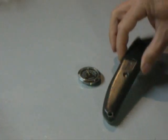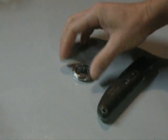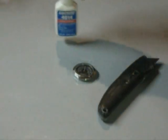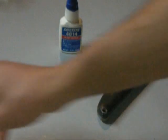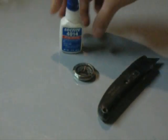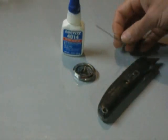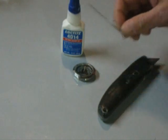Hi, this is Mike from StemCaptain, and I'm going to show you how to recalibrate your thermometer. A few things you're going to need are a utility knife, the insert portion of your thermometer pulled out of the StemCaptain base, and some kind of glue. The best kind is a cyanoacrylate, also known as crazy glue — this is just a Loctite brand — and then something like a paper clip to apply the glue.